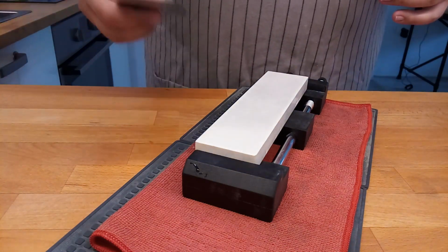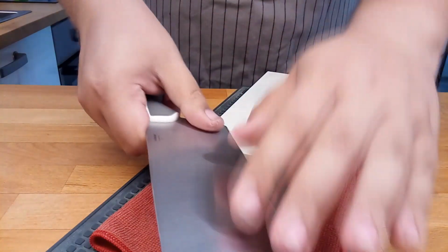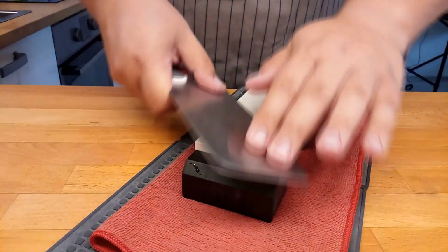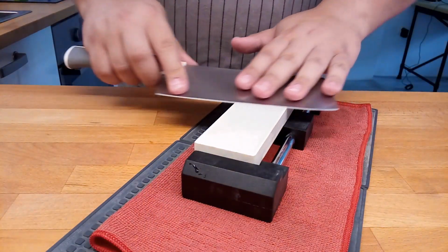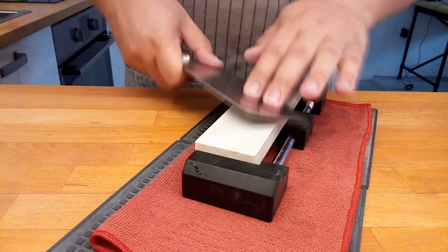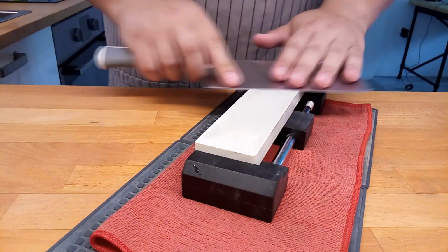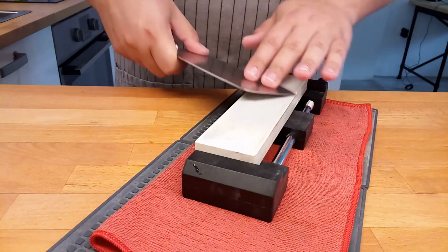And what I'm trying is a plateau sharpening. This stone is extremely hard, is conditioned with 220 grit silicon carbide abrasive grain on glass, so it cuts a little bit quickly for its grit rating. And I'm applying between 1 and 1.5 kilograms of force. Both of the stones were soaked for about 15 minutes in water, so you can see they hold up the water on the surface, or at least this one. You will see the 1000 in a minute or two.